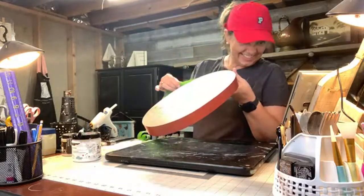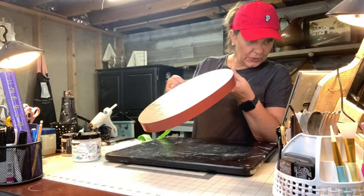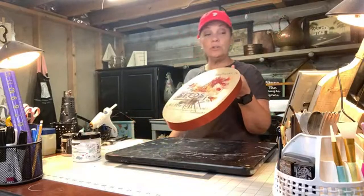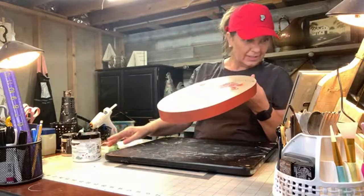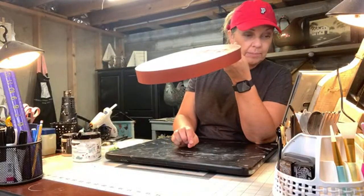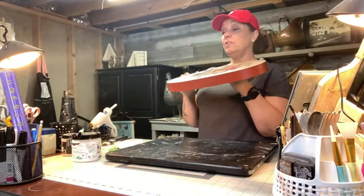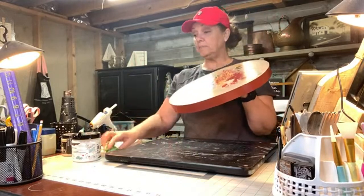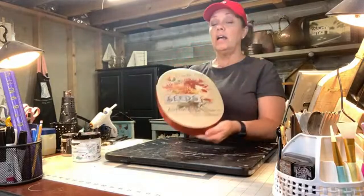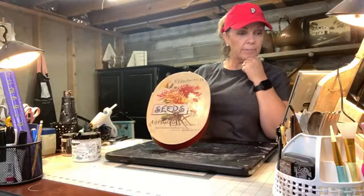Nice, isn't it? I use Big Top on my white painted surface, and it's streaked yellow. Really? I have never had Big Top yellow on anything. I wonder what type of surface you were using. I know that oil-based products definitely yellow, but Big Top's all natural. It's water-based. I could see if you used it on a piece of wood, maybe, and the tannins raised up and started yellowing. I'm not sure.